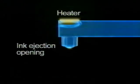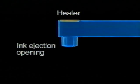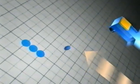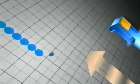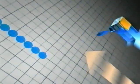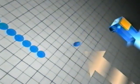Canon's new microfine droplet technology positions the heaters directly above the ink ejection opening, expelling the ink together with bubbles of air. Ultrafine, uniformly sized ink droplets are expelled at high speed with extremely accurate placement. The ink droplets form perfectly round dots, producing consistently high image quality.